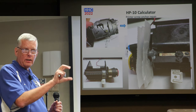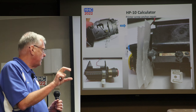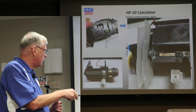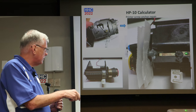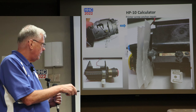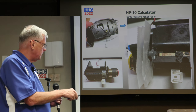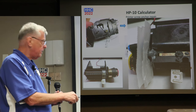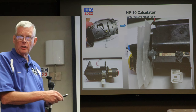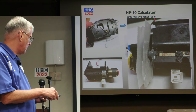So I wanted the exact registration of the motor. There's 3 points on the motor and it just held that in place and then waited for the epoxy to dry. And you'll see the lower part of this contact here. So this piece I still have, I had to glue this piece in, and this printhead, as it comes over, pushes that little copper piece up against the other contact, and that's how it knows it's in the home position. So I haven't got the top piece on. I'm still letting this all dry and cure.